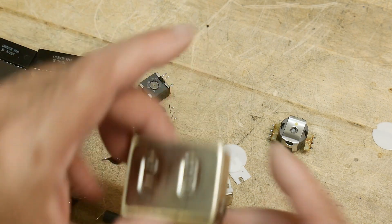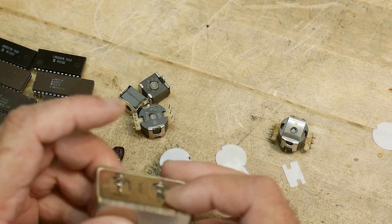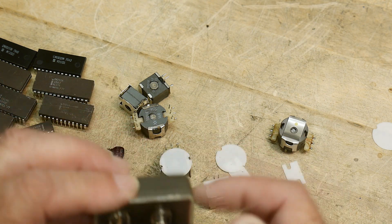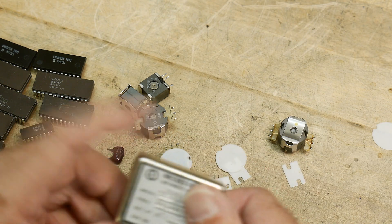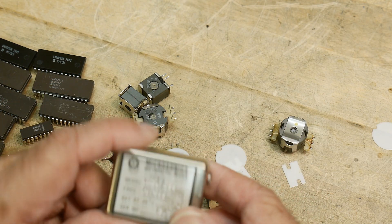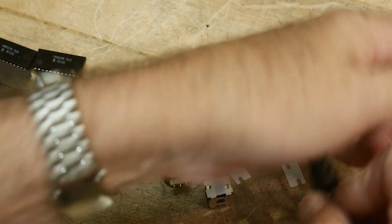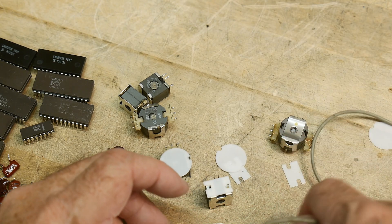I also took off the 10 megahertz oscillator, and it's a 5 volt oscillator. I should mark that on here so I don't forget later. You put your 5 volts here, and ground and RF there — RF is 10 megahertz, I guess. I adjusted this last night for 10 megahertz, so let's go ahead and hook him back up. We'll let him warm up again and we'll see how far he has drifted.